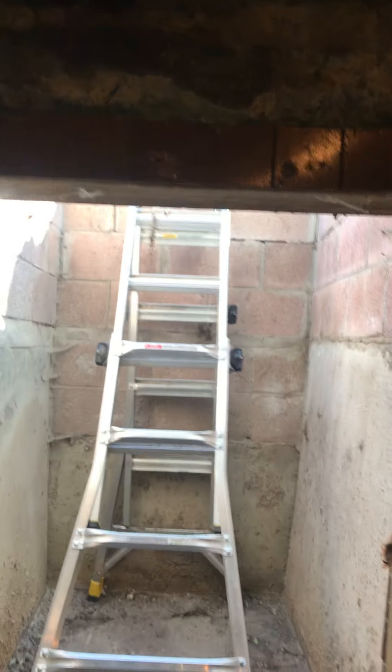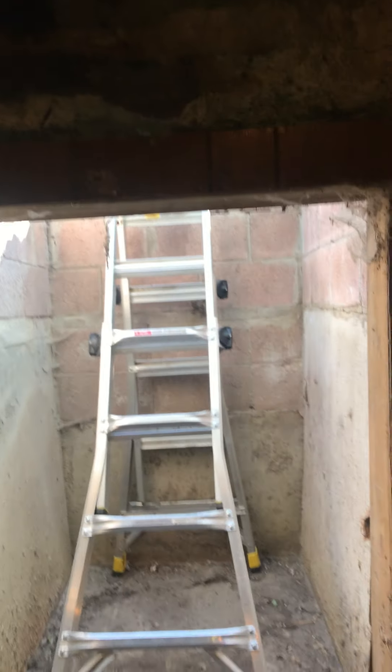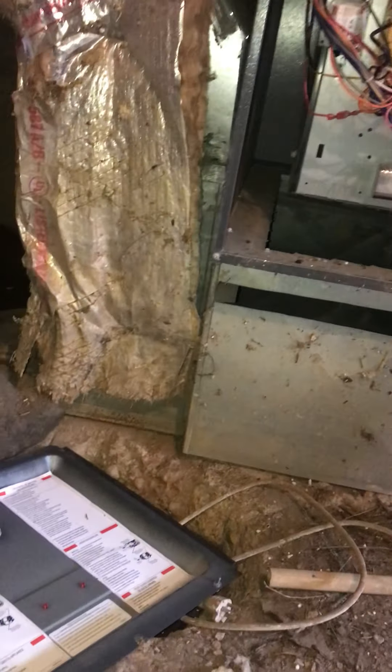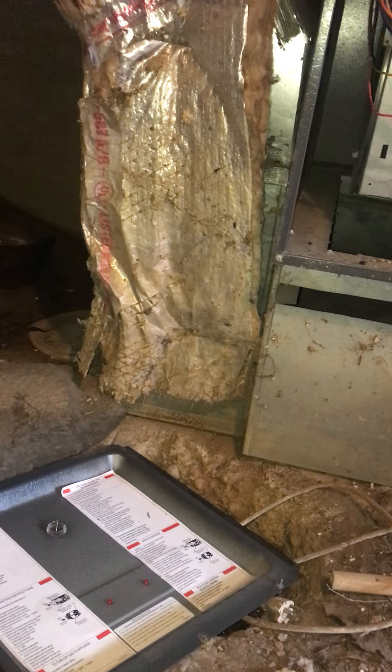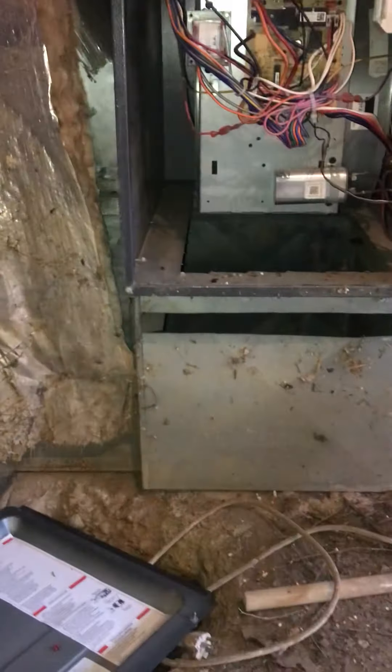So that's basically what we're looking at here. There's a crawlspace access down there — you'll probably need to bring a ladder if this ladder isn't already out here. We'll be doing three-quarter PVC, running it into the sump. You'll need a sump before we really have this running — that's my assumption, I could be wrong.